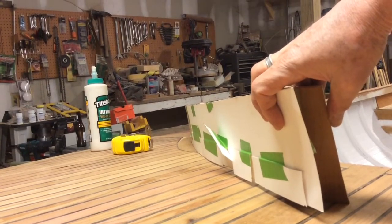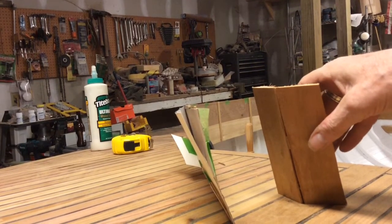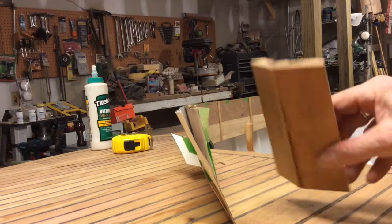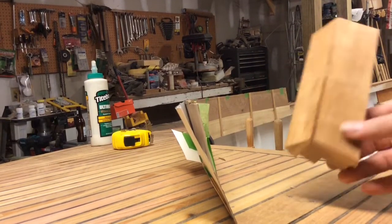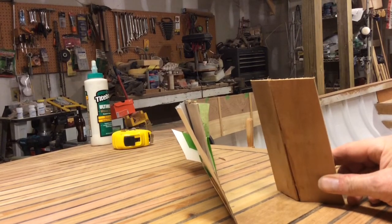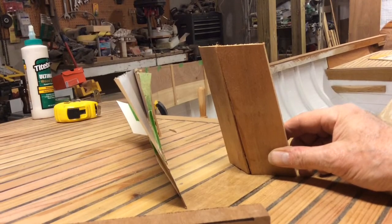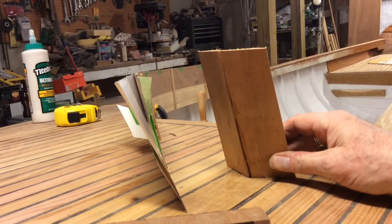It's way better. It looks like that should hold it — you can see there that it's pretty much the right facing angle on that side. I feel way better about it. What I'm gonna do is drill a hole in there and put a dowel rod in, then drill a hole in the deck and glue that down in there with the dowel rod, and also up inside the post itself, and then epoxy it onto the deck as well so that shouldn't move.